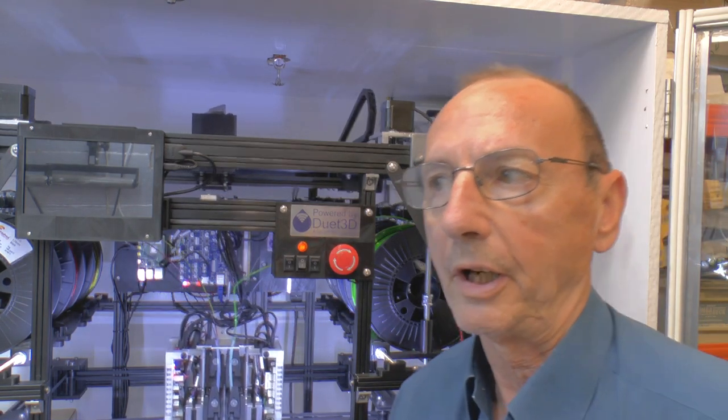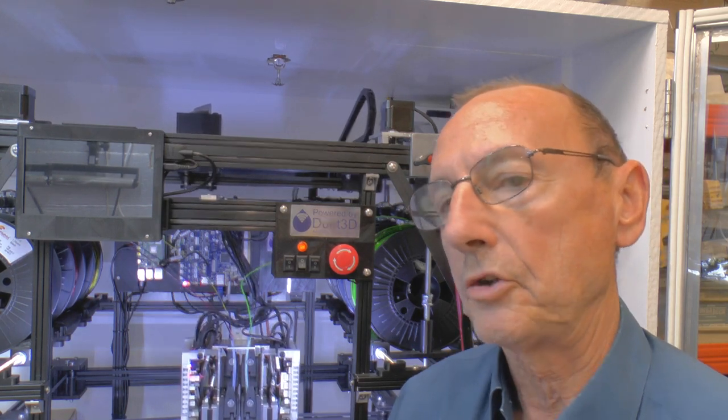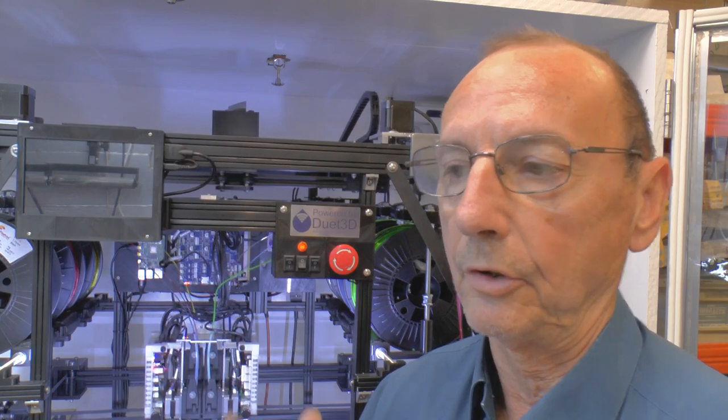and that's the AB gantry. So normally, and up until now, whenever I print something, the axes get split into X, Y, U, V, A and B for homing. And then the axes have been combined so that as far as the print is concerned, it's just a single XY, so it's just a core XY for print moves, so you can have a standard G-code file.